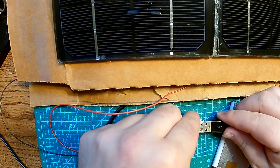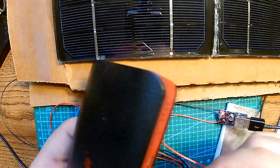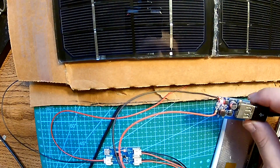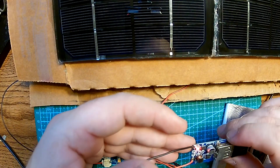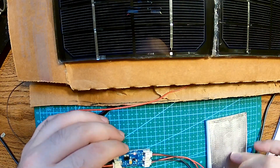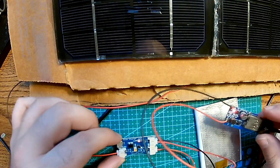Let's see if we can charge something. I'm going to take the cable, plug it in here, and get one of these old battery power banks to see if I can start charging it. Voila — it's charging! That's a great sign. Before this, anytime I plugged anything directly off the solar panels this little setup wasn't able to do anything and just shut down. But with this little board based on the CN3065 and the help of this old battery salvaged from the HP laptop, it's working! Awesome — thanks for watching, hope you enjoyed this short video. Stay creative, see you next time!